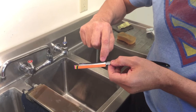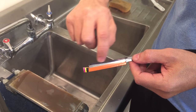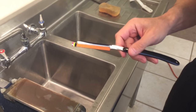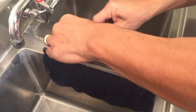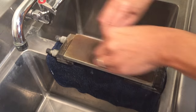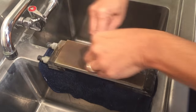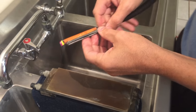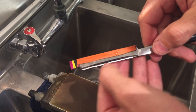Let me show you how I do it. I've prepped the razor — I put the four layers of tape on, and I've also marked the bevel with a marker. I'm going to take it to the 400 diamond plate and knock it down until we can see just a little black line of the old bevel. Here's my 400 diamond — we're just going to go to town on it. I'm not being gentle; I'm putting as much force as I can. You can see there's a fat line on the spine — we're going to try to get that thinned down.